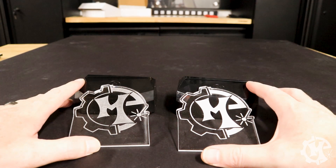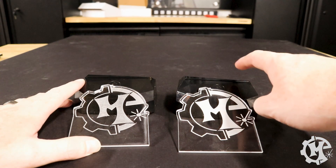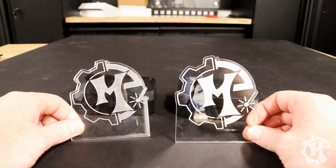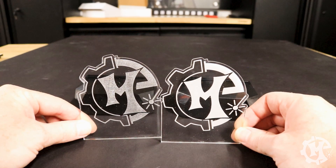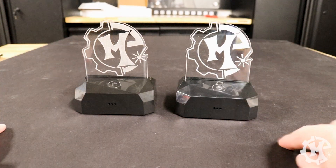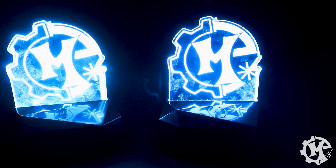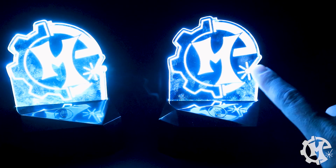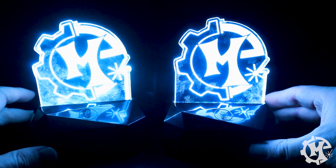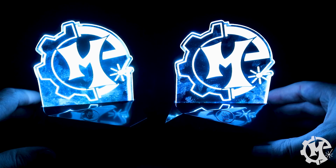I have these light bases from Johnson Plastics — I'll put a link and a promo code for five percent off in the description. The cast acrylic is on the right, extruded on the left. You can definitely see the difference in engraving quality just by looking at them. With the lights off and the LEDs on, this one is just a little bit better diffused and better lit. The left one looks grainier in real life. The LED light shines better through the cast acrylic, and even without lighting, cast just engraves better in general.